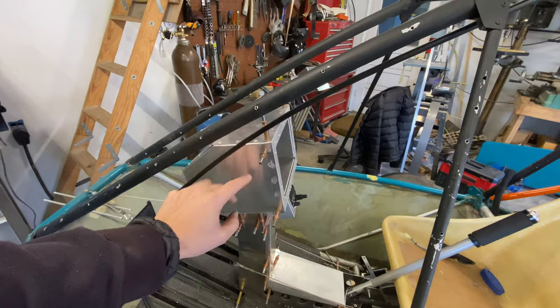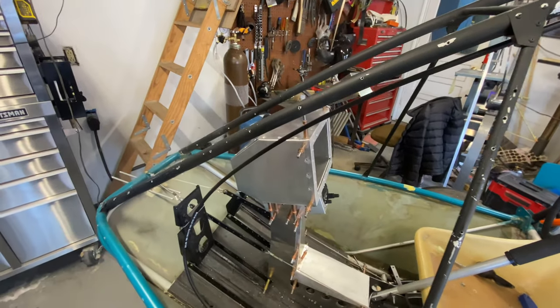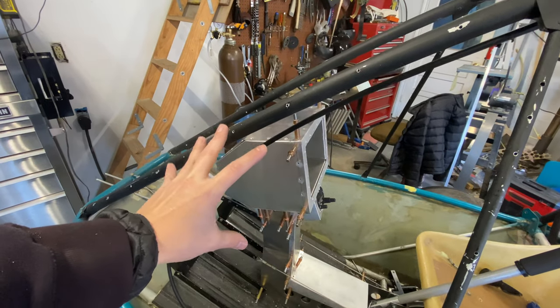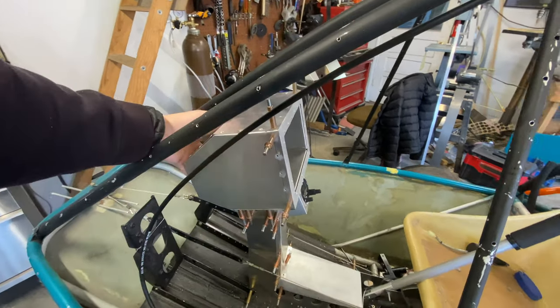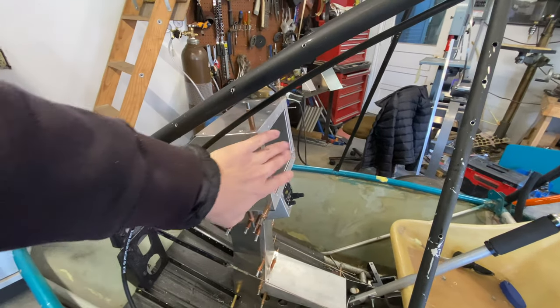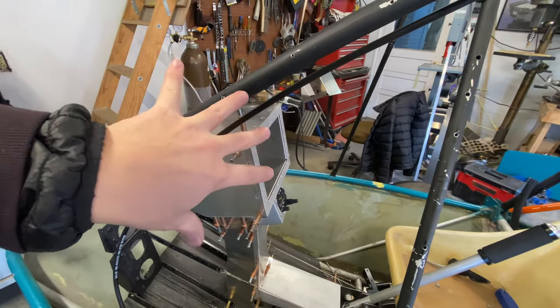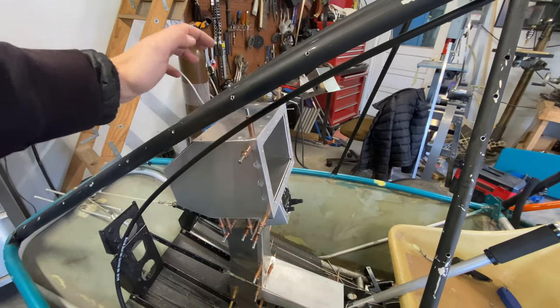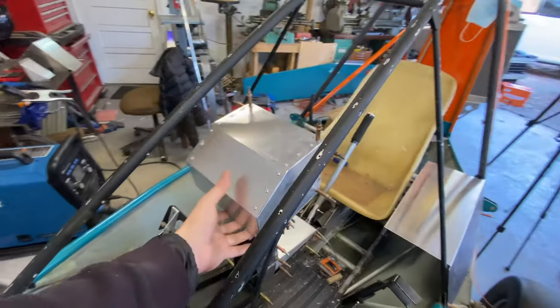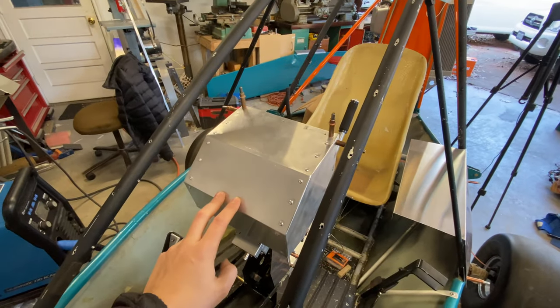It's not going to be permanently riveted together as one. This is effectively the glare shield, which will be removable. That'll screw on and off, and it'll leave that lower section that we had earlier just sitting there with the Dynon. But this means that the panel is now rigid to the front. The front no longer wants to wobble. That'll hold everything steady while it's installed. It'll keep the sun off the back of things. It just generally protects everything.